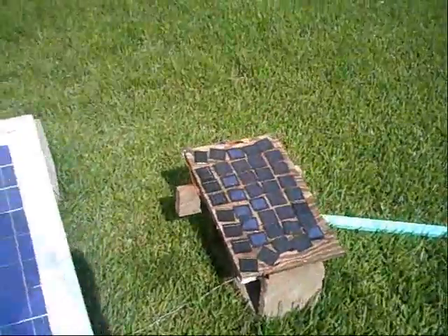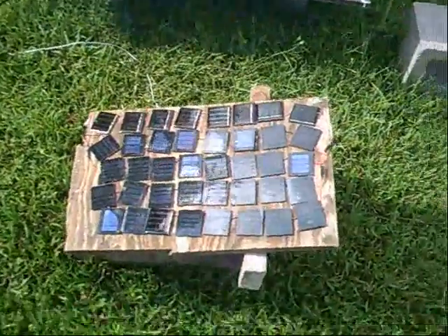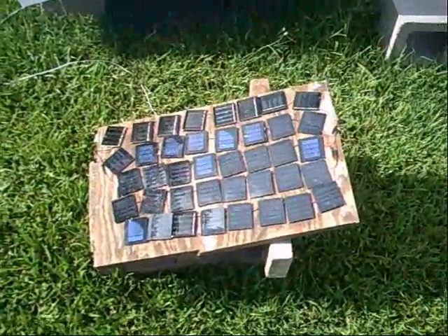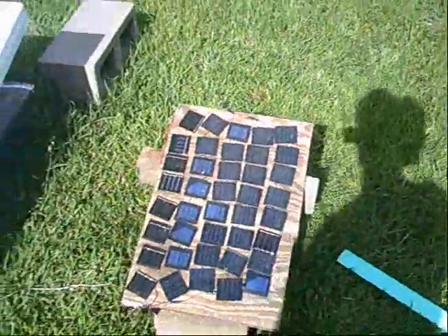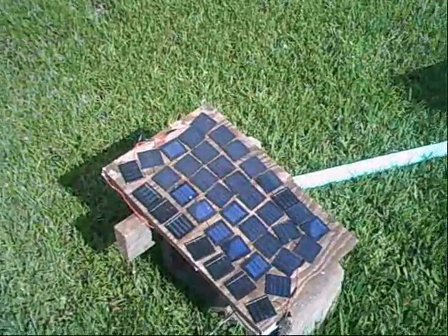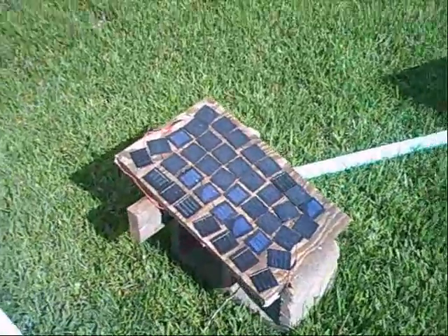Here you see my very first one. It doesn't look like much and it produces even less than what it looks like. But give or take, it's roughly about a five and a half, six watt panel. It consists of basically forty of those little two volt, twenty milliamp things out of solar yard lights or driveway markers. I used to think it was a big waste of time as far as output versus time and money spent. But looking back on it now, it's not that bad because the cells are thick — they're very hard to break. I even tried with a pair of pliers and they're virtually indestructible. Still, it probably wasn't quite worth the money spent.